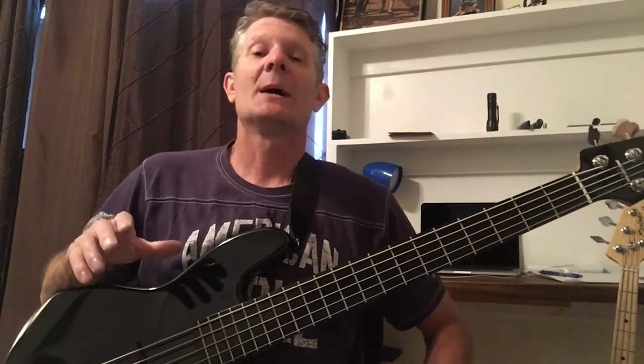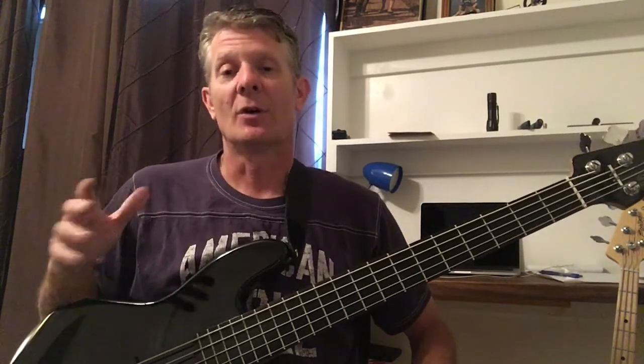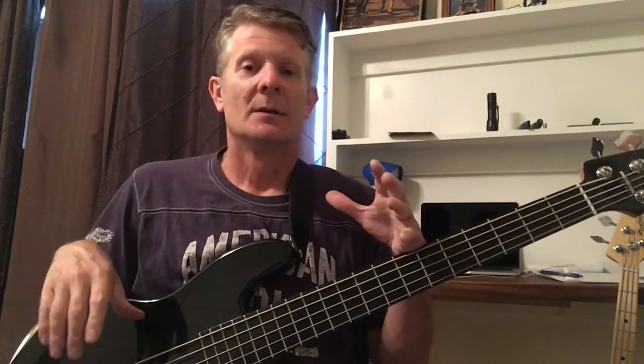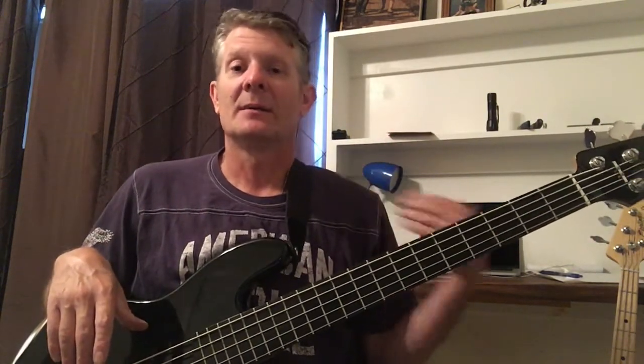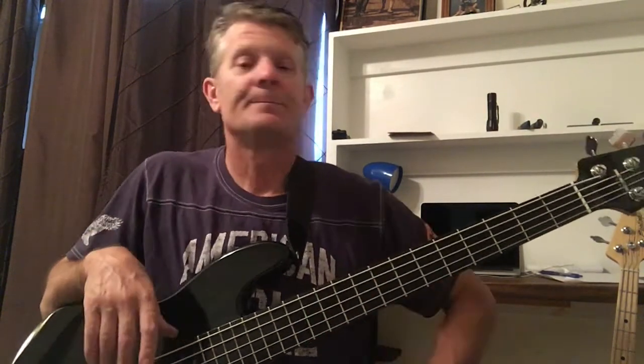And most of the time, if they say it's 1,000 watts peak, probably half of that is what your RMS will be. Probably. It's not always a given. It's not a given that that's going to be half of that number, but it's going to be in that ballpark. So what you're looking for is the RMS.